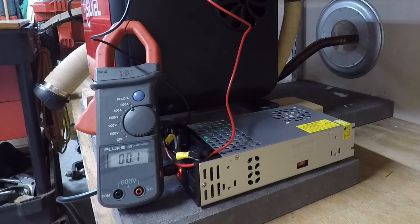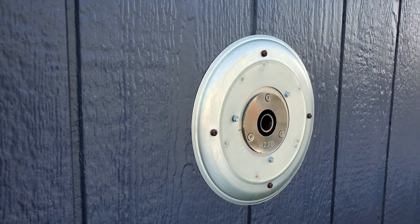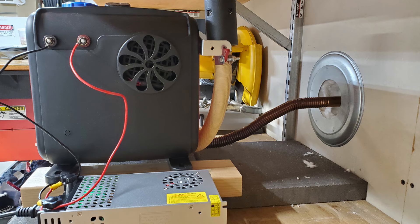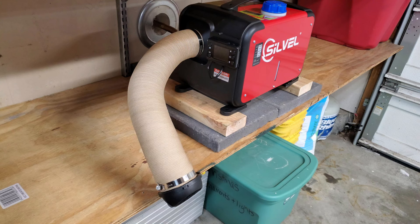I've got a very oversized 30-amp power supply that'll be the permanent power supply, but you could probably run it with a 10-amp. Here's a quick shot of the exhaust on the outside while it's running — it's a little noisy but it's over my trash cans and I don't plan on hanging out in that area. You can see the setup with the exhaust going over the paver, the intake air, the hose clamp installed, and how that ceramic fiber insulation looks. There's my overall clearance at the bottom — I'm using two-by-fours on the sides but I think that's far enough away from the exhaust. I appreciate you guys watching — this is how I did it and it works really well for my garage, warming it up fairly effectively while I'm out there working on something.